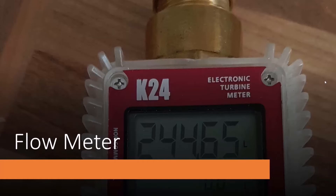I bought a flow meter from AliExpress — very cheap, 20 euros. I want to do calculations on how much power I'm getting out of this thing, so I need to know the flow rate of the water. In my water circuit I have this flow meter and it's surprisingly accurate and reliable. I did a few tests and actually measured the volume of water it said it was metering, and it was bang on.